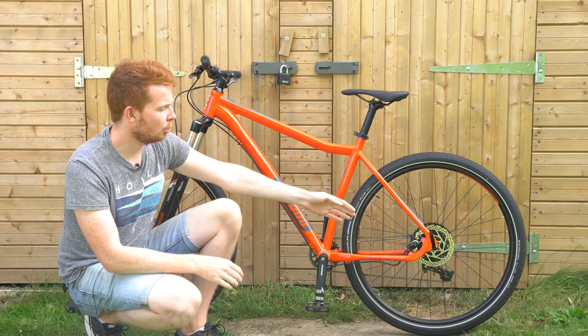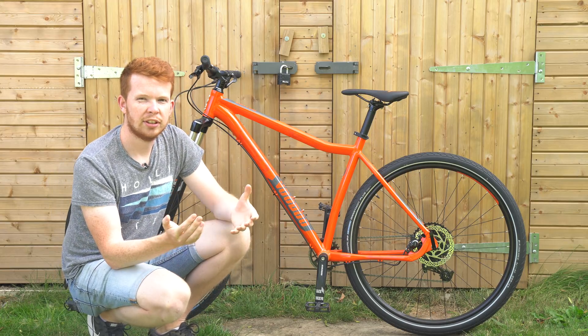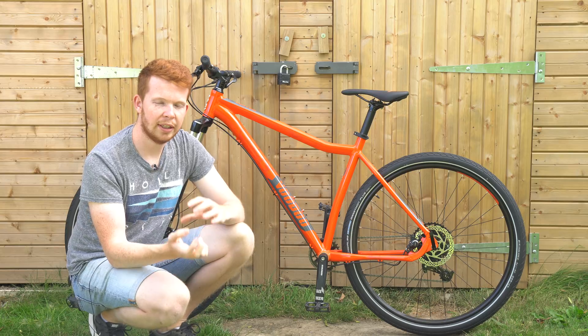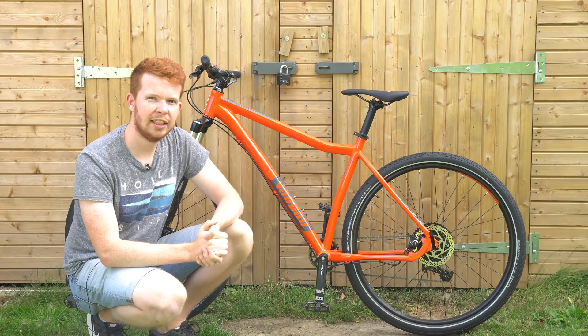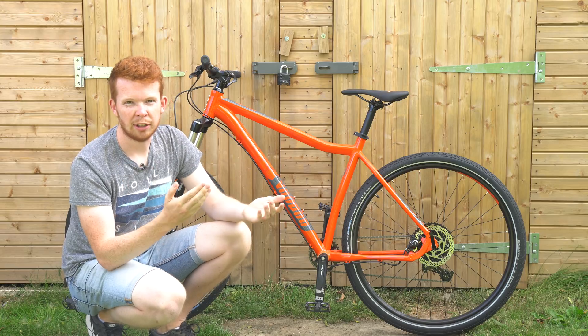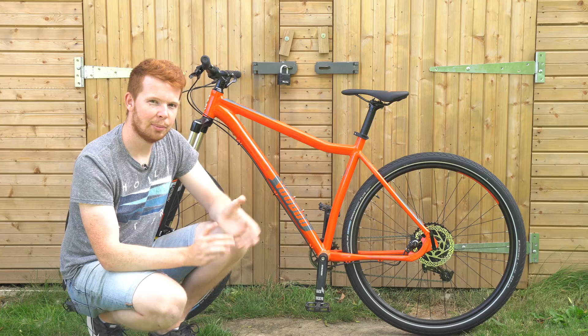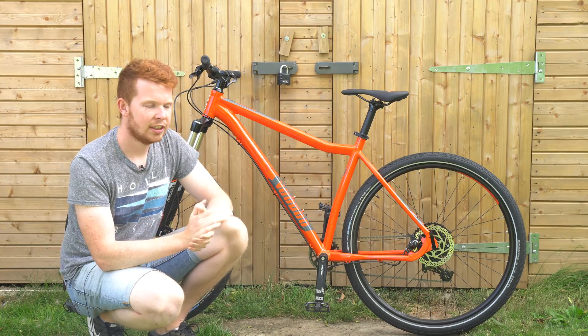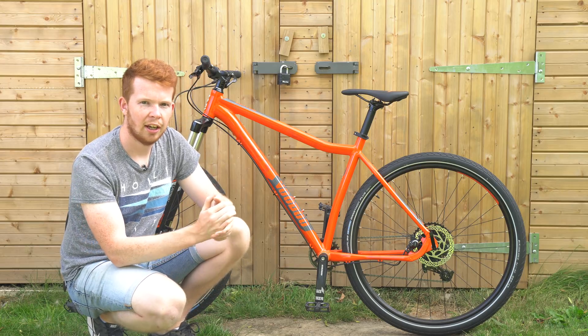But it still put unwanted lateral force on all of the spokes. Now as this bike has a disc brake, I want to utilize the mounting point of the disc brake mainly because it's a really strong point on the wheel and the hub - it has to stop the bike really quickly, so if it's designed to stop the bike really quickly, surely it should be able to work in reverse and accelerate the bike really quickly. The only issue is that the disc brake doesn't leave much space for the pulley to fit into.